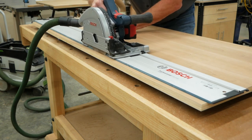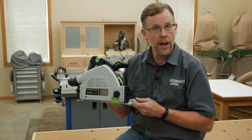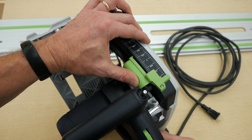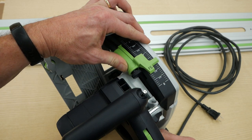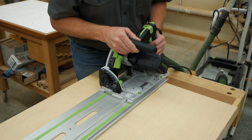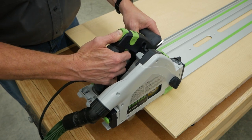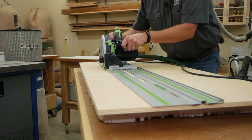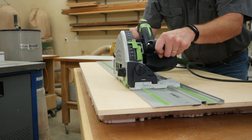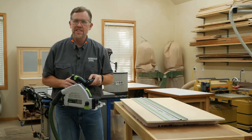There's never a downside to cleaner cutting. If you've never used a track saw before, here's how easy it is to set up and make a cut: line up the guide rail with the cutting marks on your workpiece, adjust the saw's depth of cut so the blade projects slightly below the workpiece when fully plunged, then set the saw on the guide rail so it engages the channel. Press the plunge release, squeeze the trigger, and plunge the blade fully. Then just feed the saw along the guide rail slowly and steadily to make the cut, pressing the guide rail down as you go to prevent it from shifting.